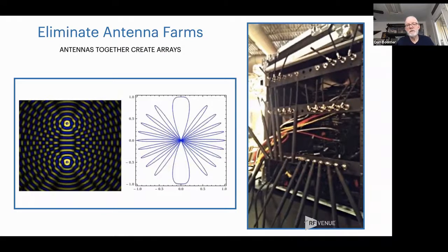The second problem: when you put a bunch of antennas together, you create an array. Just like when you put speakers together and create a line array, when you have antennas together you get an unpredictable pickup pattern — unless carefully engineered. That's how paddle antennas are made — multiple elements very carefully aimed and calculated to combine into something you want, much the same way as speakers stacked in a specific way create a line array.